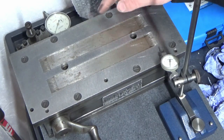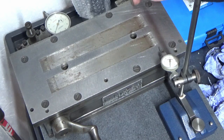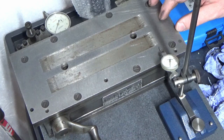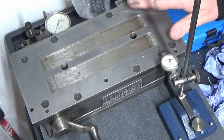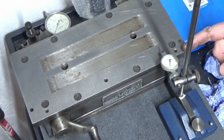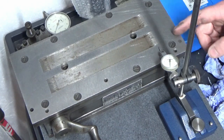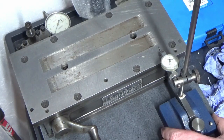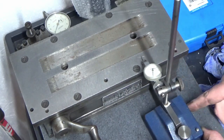a tiny bit of something underneath it before, and there is a slight linear taper, but it's a lot less than what I'd measured. It's about a tenth or 2 tenths of a thou to the centre, and by the time I've got over this side, we're measuring about 4 tenths of a thou, and it is completely linear across it. So it's flat, and basically same job.